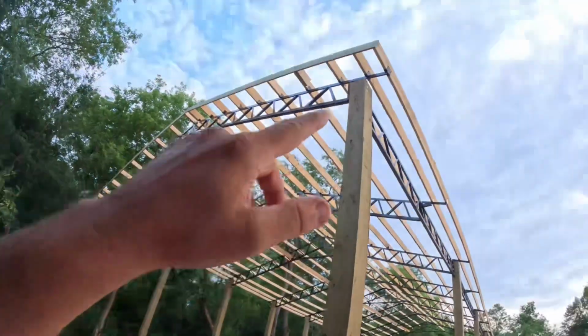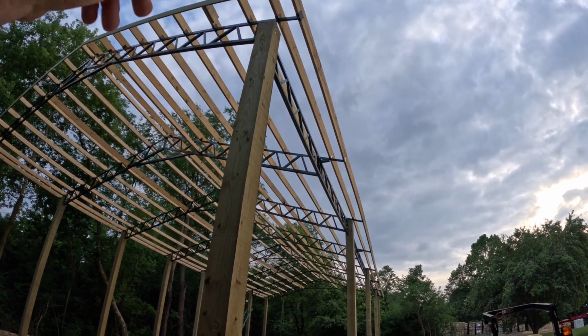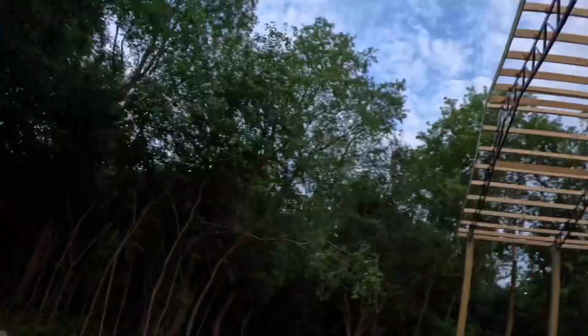So first thing in the morning we'll be starting at 10. We just got to put the drip edge on there all the way down, so we'll probably do it as we go, put a section up. But obviously the most important part of the roof is the first section of tin. It's got to be perfectly square, otherwise 70 feet later, if you're off even 1/4 of an inch, you're going to be off 2 feet down there. So maybe not that drastic, but pretty close.